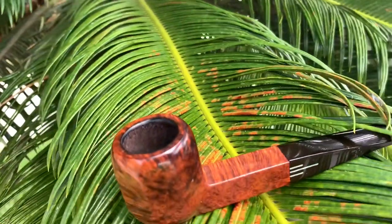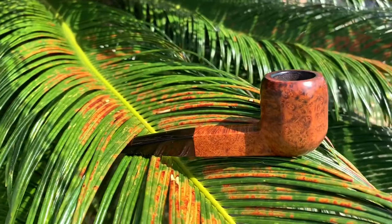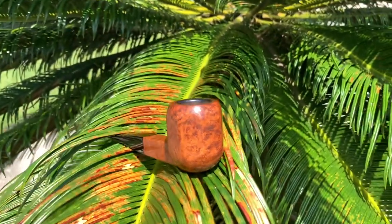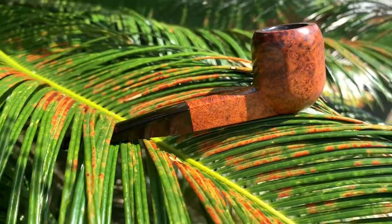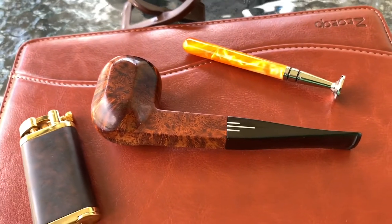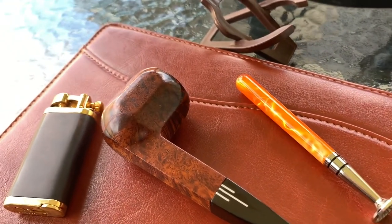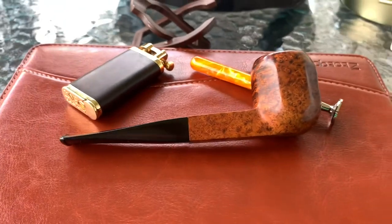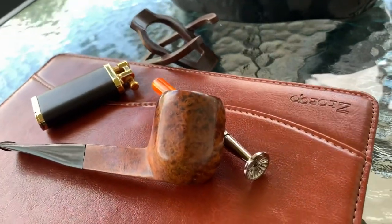Really the only tools I used were a drill — I don't have a nice buffing setup, I just use a cordless drill and some buffing wheels. I use red compound and white compound on the stems, and just white diamond compound on the bowl itself. The buffing pads probably cost me $10 and they came with a couple of the compounds. The block of carnauba wax, which will last me forever, was like $15.